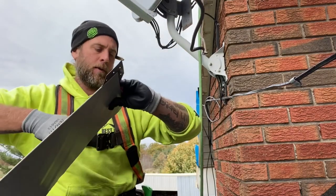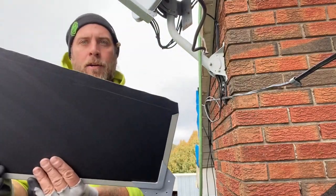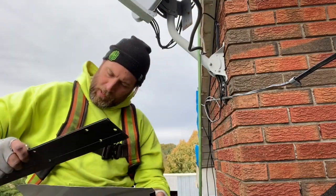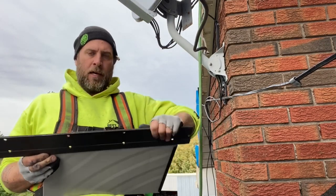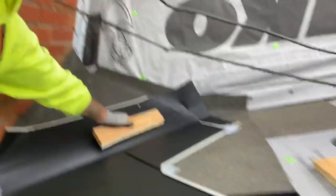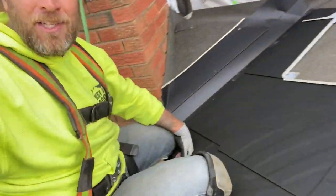Don't forget to cut your folds out. Now you've got your folds cut out. Take your two-foot bender, put her in on your bend line, and fold down. Your shingle should slide right into place. You can use a piece of wood just to tap it in a little better. I'm hand-bombing this video today, BDR style — this is my Roofing University, that's how I roll. Valley's looking good.